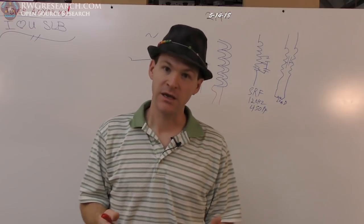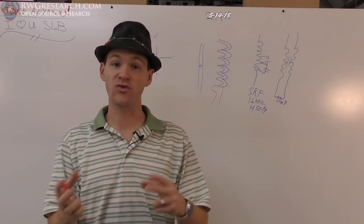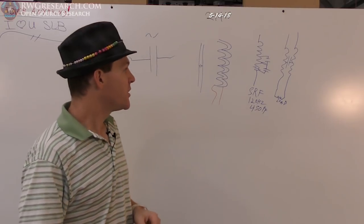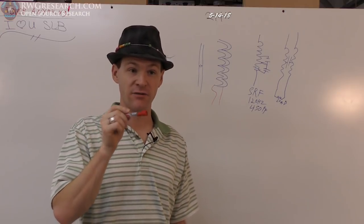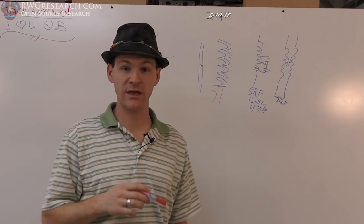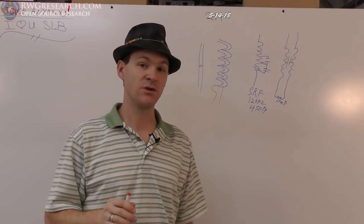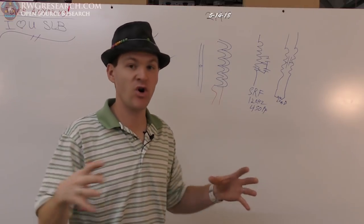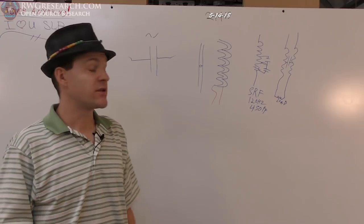The question becomes really simple: can you generate a potential in a coil that you can use without causing drag on the magnet? With an open-ended coil you can generate voltage — it has nowhere to go, it can't make a loop, so it doesn't produce a significant magnetic field. In a small coil you'll probably never see it; in a big coil I can actually see a tiny little bit, but not much at all considering.